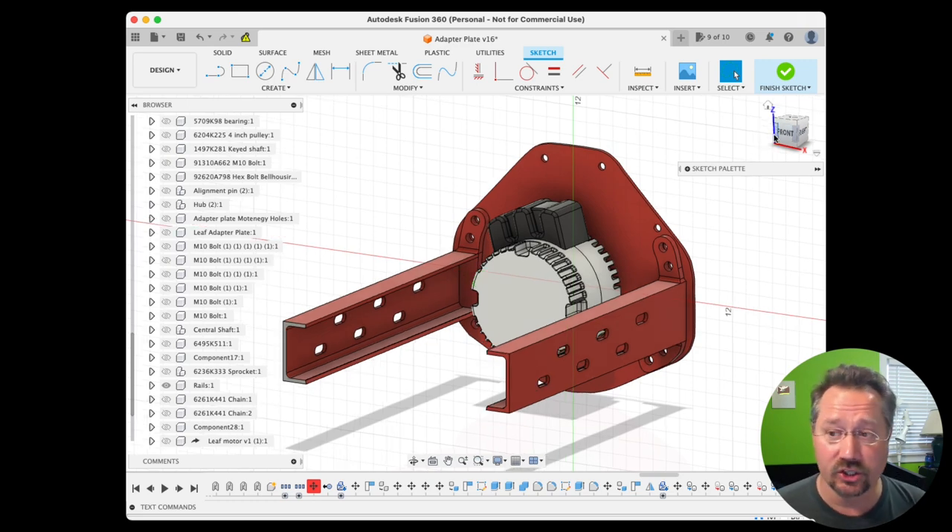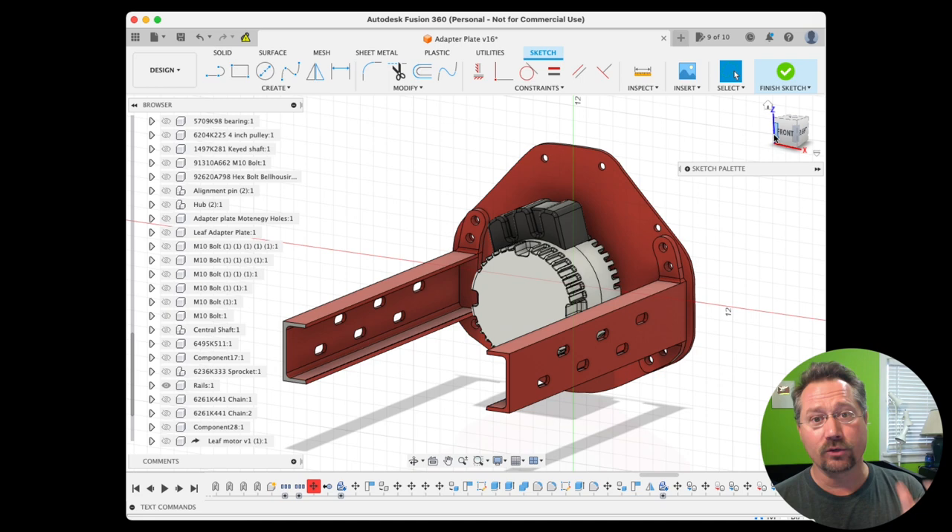Now there are still some challenges. This motor is lower power than the original gas engine. But at the same time, I already have a separate motor specifically for running the hydraulics — a separate hydraulic pump motor stripped out of a forklift. So the hydraulics should actually be a lot better than in the original setup, which just used a small hydraulic pump on the back end of the engine that was always robbing some horsepower. By splitting up the motors, I should be able to get away with using a lower-power drive motor.